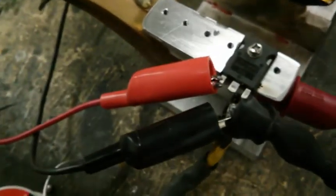Okay, I had some success with 3 LiPo packs in series running a 4110 MOSFET. It worked out to around 130 amps through the damn MOSFET. It's incredible. It did blow up, loading it down like that twice. So it's obviously not going to last long, but it seemed to be not a problem for a 4110 to run 89 amps.